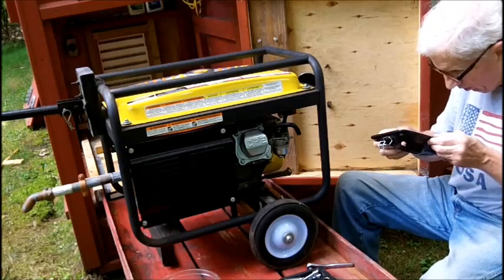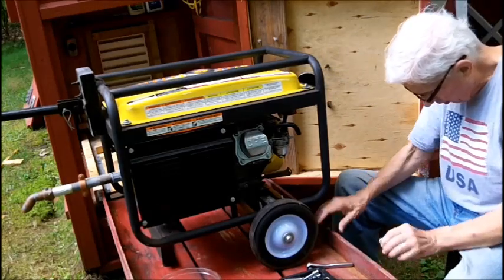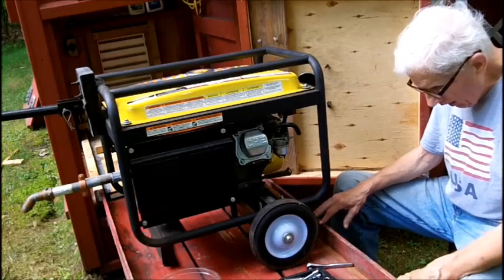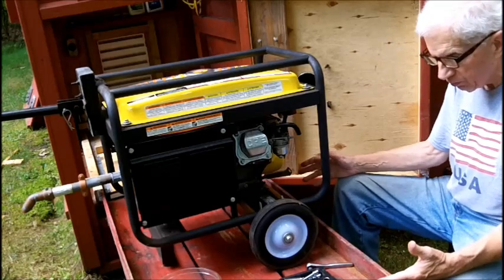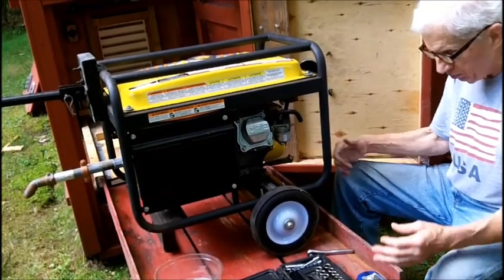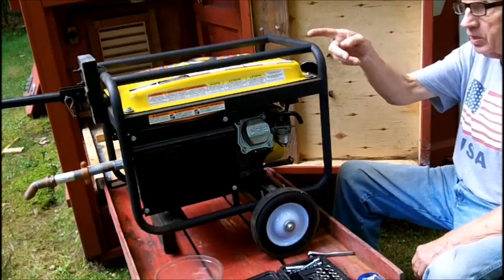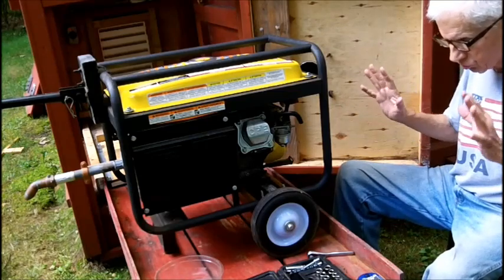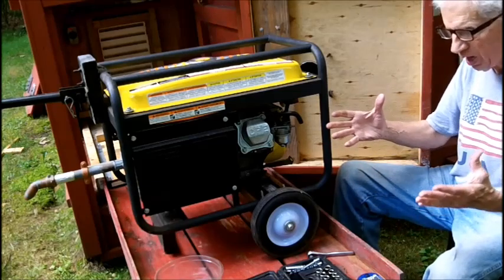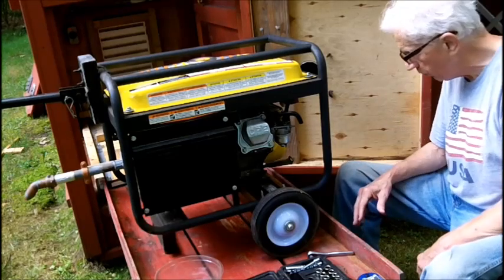Now I've got to clean this up. This is why I made this thing here. It's a little loose — it's rotting, because this is not pressure-treated wood. The problem is I only had a tiny bit of oil-based paint when I built this. Like everything else, I'm always running out of something, so I mix it with paint thinner and soak the wood. Storing anything under the house — everything under there is musty. It's on the ground. Even though it's not sitting on the ground, it's sitting on 4x4s, and I got plywood on top of that, back in the good old days when I could get bargain wood.